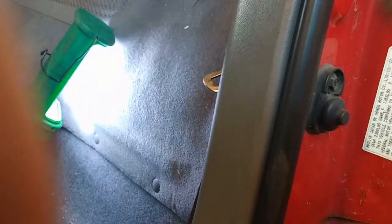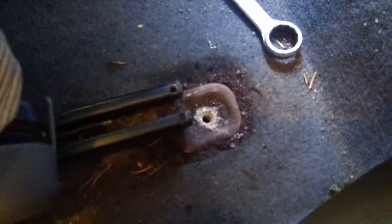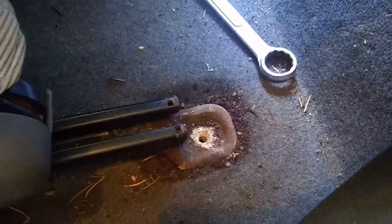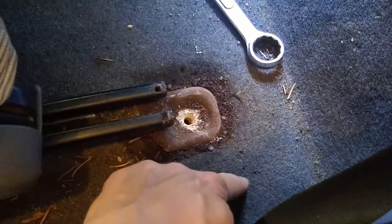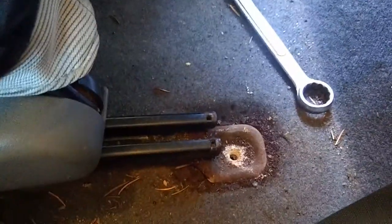You can see that hole is pretty corroded. There's my fastener welded on there — there you have it. One other pro tip: I'd never do this by carpet with a flux core welder or a stick welder. There's just too many sparks. I've got some BBs burning their way down into the back of this carpet. I'm going to douse this area in water after I get the seat out, and maybe pull the carpet out just to make sure the car doesn't start on fire. That's how you get a stripped bolt out.